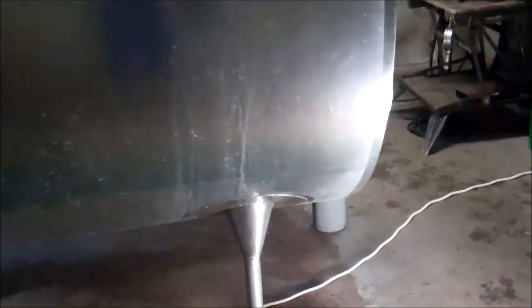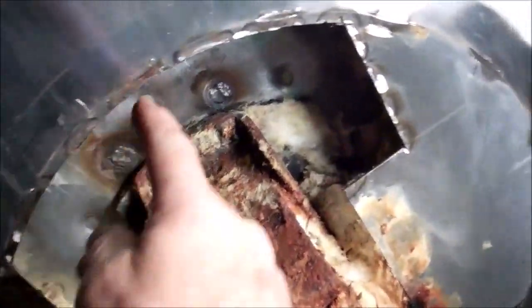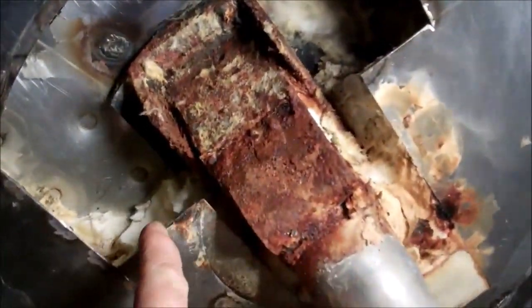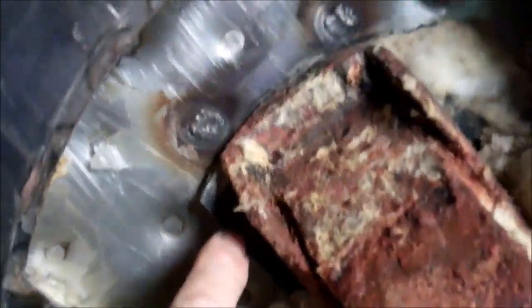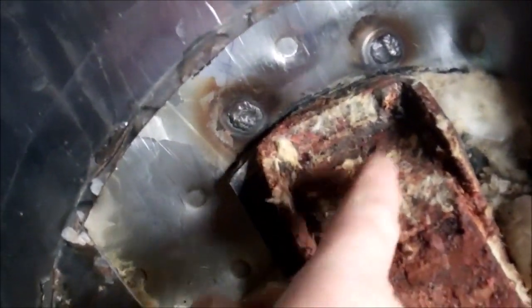I've located a leak near the back corner, cut the panels away, and cut an opening through here as well. That's where it was repaired last time, on those two spot welds. And now the leak is lower down, behind this frame.